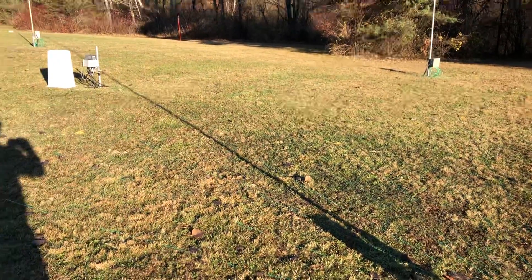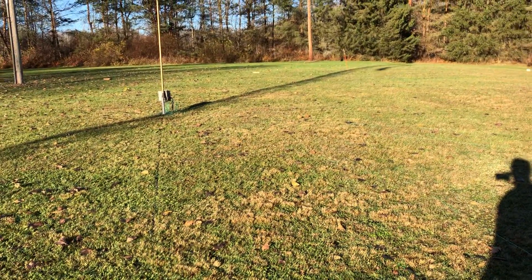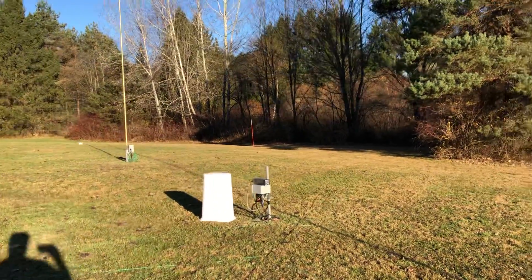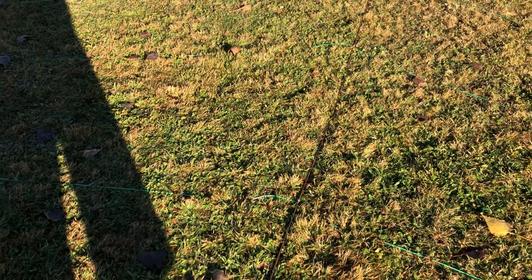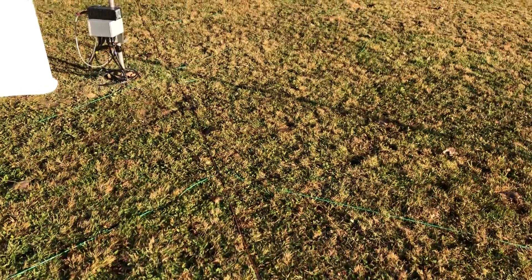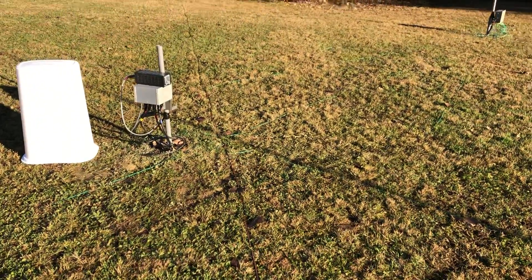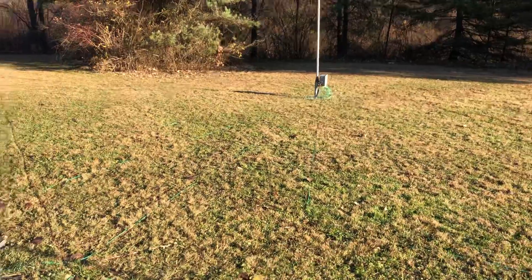So if you do all that math, I figured I've got just under 4,000 feet of wire laid out here in the last couple of days. Over the course of the winter the ground will soften up and these things will disappear — as the grass starts growing next spring, they'll really disappear. I laid out some copper and connected all the radials that meet, and you can bond them together rather than having them overlay each other. Being able to do that saved a few thousand feet of wire easily.